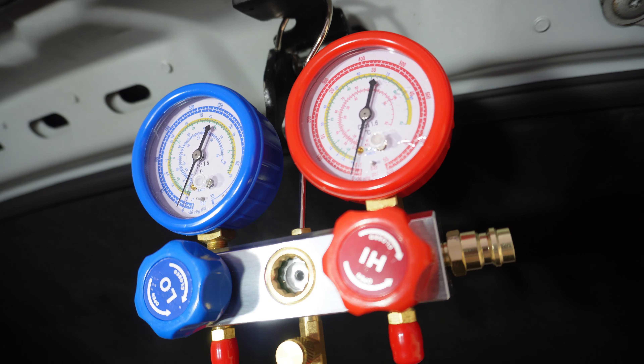We're getting there — the car is freezing. We're dropping to 2.5 degrees and now it's like one degree, almost zero degrees AC. Should we be greedy and fill some more? It's almost zero. I think we should leave it there — don't be greedy. The pump has stopped and I'm only about 10 grams under the spec, which the sticker says is plus or minus 10 grams, so it's okay. I have a great AC that reached zero degrees, so I'm happy and I'll leave it at that.